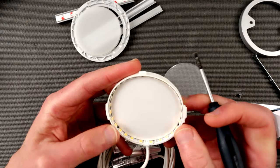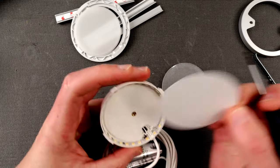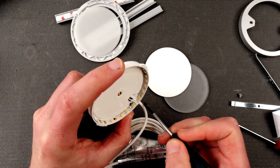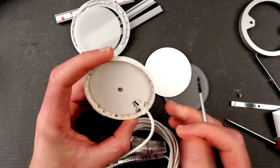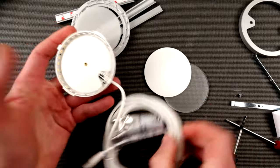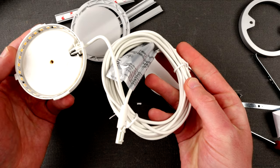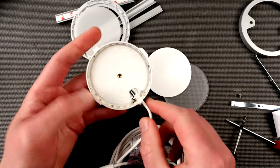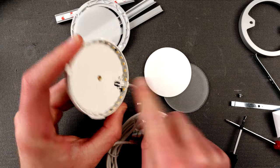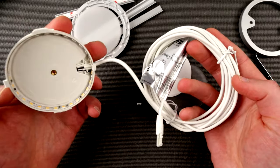Very interesting. So this device, I think, can I take this reflector out? Yes, this reflector plastic thing can go out. And here we are, we have access to the LED strip over here, and we have access to the LED connector. So if you want to shorten this wire, because it's ridiculously long, I think it's about 3 meters or something, we can actually cut it to the size we need and resolder it right here, because dealing with this piece of wires is actually quite ridiculous.